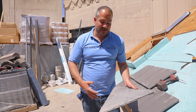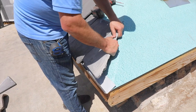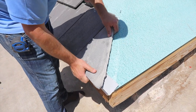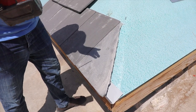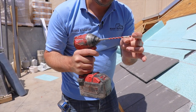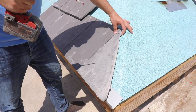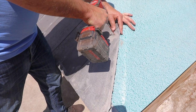Now that we've got this tile cut, we're ready to install. We're just going to slide this into place. Being that we already cut the preset nail holes off, Marco already made a hole, but you just want to use a drill — an impact driver with a diamond tip, made for masonry. You don't want to use a hammer drill, as it's going to break the tile. Just drill there and now you have something to nail against.